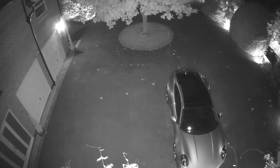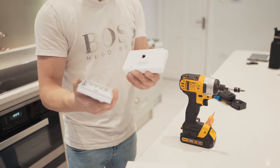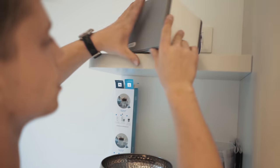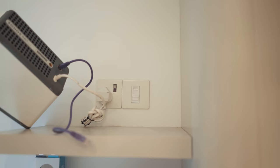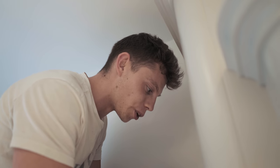This is the in-wall HD — the souped-up version of the in-wall access point we just installed. It's got MIMO and it's Wave 2. It's going to be going in the kitchen where a lot of the WiFi traffic is concentrated in this house. A nice thick HD access point with all these features and four ports on the bottom for hardwired devices. There's a Sonos player here and the owners have had an Ethernet port put in the wall, so I'll install the in-wall HD and still have Ethernet ports available for the Sonos player. For wiring, I use the B schematic: white-orange, orange, white-green, blue, white-blue, green, white-brown, brown.